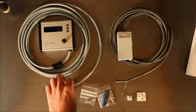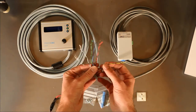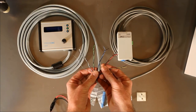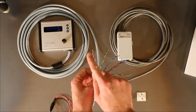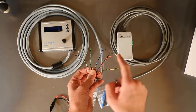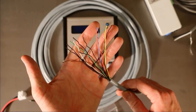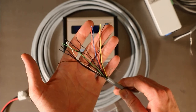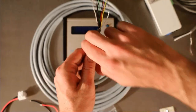The main unit has a 12-core, 6 twisted pair cable. Twisted pairs are generally used to reduce cross interference of signals from one pair to another. Each twisted pair has one coloured wire and one black wire. The only way to identify any of the 6 black wires is by the coloured wire it is twisted with. If you lose track of which black wire is associated with which coloured wire, you may need to strip back the outer sheath of the cable a few inches to see which wires are paired.